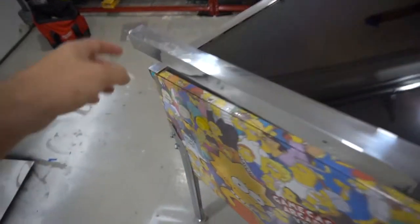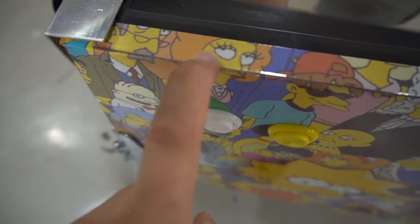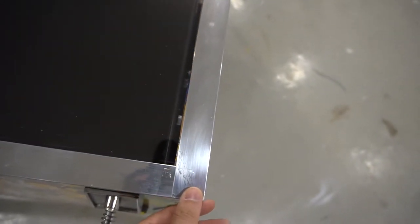It's got this white laminate, but it is real wood birch being used for this cabinet. My personal cabinet was using MDF, but on this one I found a white laminate birch — really cool, really clean, especially when it came to applying the graphics. I don't have to sand anything down. Keep in mind the original wood is three-quarters, then you also have a little bit of a gap for the actual TV. So with this I believe it's one inch — three-quarters is the wood, and I used one-inch chrome railing with holes on one side.